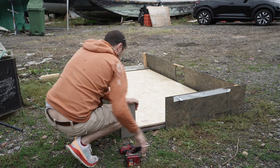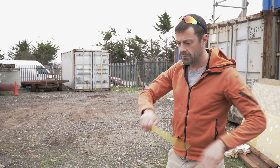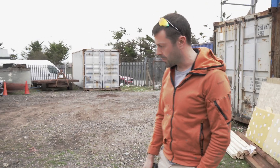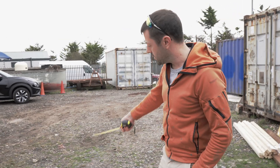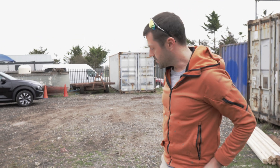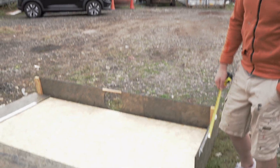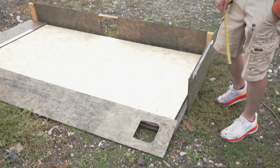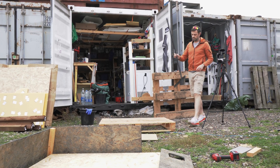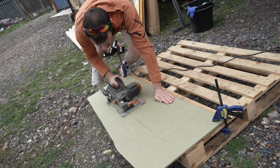Next, I need to get the foam oven out again and make it even better. So we're expanding the foam forming oven heating area because we need to do a larger sheet. I think also we were getting the duct where the hot air comes in a little bit too close to the foam and it was causing a little bit of warping in that first little zone. So to save the foam, we'll just try to make the whole thing a little bit deeper. But it turns out that the piece of spare OSB that I've got is three centimetres too small, so I'll have to cut some more. Key facets were low volume and as decent an airflow as possible so the foam is heated evenly.